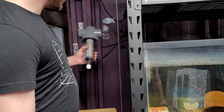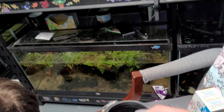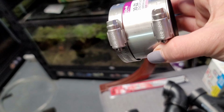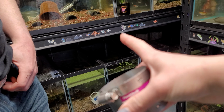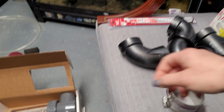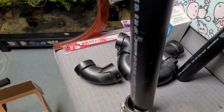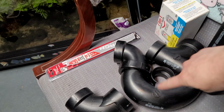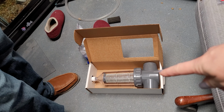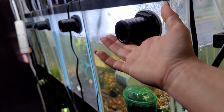And we have to have a trap for sewer gases. You're gonna use this thing called a band. And this is gonna be the adapter that goes on our metal pipe, the 70-year-old cast iron pipe that's back there. Then we stick one of these in. That's how you adapt it into your metal piping. Then you do your squiggle and then your strainer. And the way it's going to go is all around town, all of these overflows.